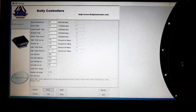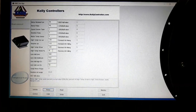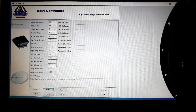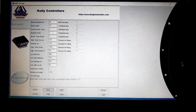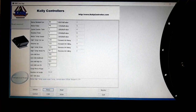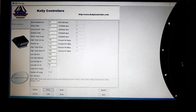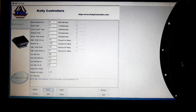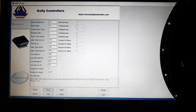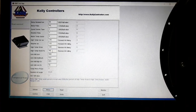The last value sets how much power we want reduced from the motor to let it cool. Usually 50% is used: when the motor reaches 100 degrees it starts to decrease overall power, and if temperature keeps rising to 110 degrees it will reach a 50% power reduction. You can put higher or lower values by practice, but 50% and the thresholds of 100, 110, and 130 are very reasonable starting values.